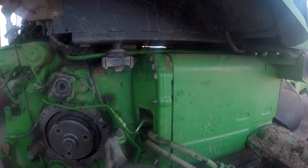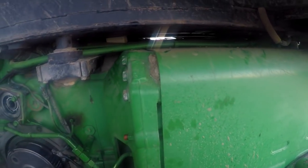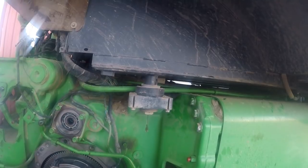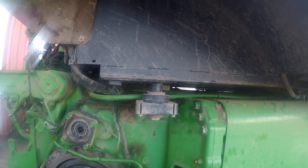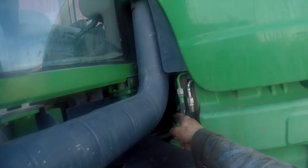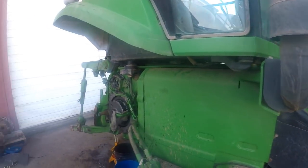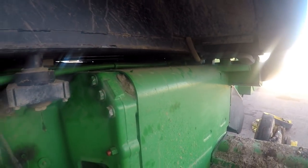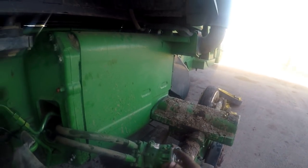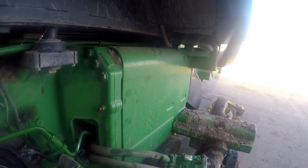This is just hydrostatic steering. On the old 45s and 55 Challengers there was nothing electric on them. I knew those steering systems well because I used to install auto-steer GPS systems on those tractors. Those old Challengers were all mechanical — instead of a steering input assembly with three sensors, it was all hydraulic, running off pilot pressure. When you turned the wheel, that pilot pressure sent a signal directly to the displacement control valve on the pump, which moved the servo pistons on the hydrostatic pump — doing the same thing the EDC does here electrically through coils to port oil the correct way for left and right turns.